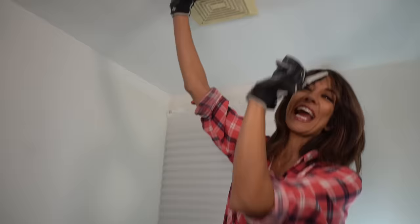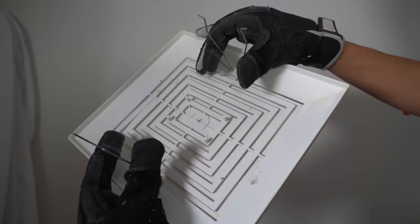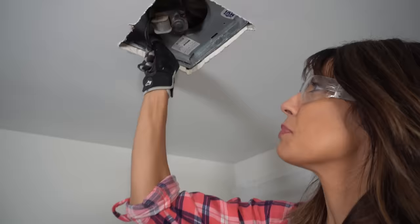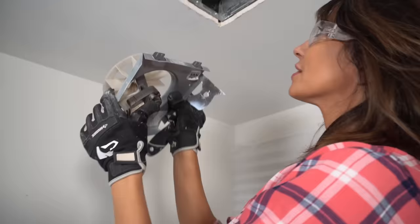We have no access — anything can happen. To get rid of one of these old bathroom fans, all you have to do is pull it down. They have these little clips; you're just going to push them in and that is how you remove the cover. We have turned off our power at the breaker and we're just going to unplug the fan. I'm using a little putty knife to loosen this up a bit. There we go — this is the old fan motor that we're removing. Now we can take a look at what we're dealing with up there.